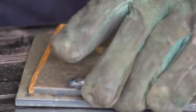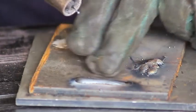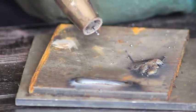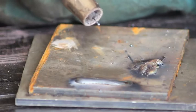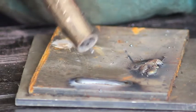But just for general purpose use, that is the kind of noise you want. You want that high speed — it's seeing a nice crisp note. And if you increase the amps, then you need to increase the wire to get that setting every time. If you decrease the amps, then decrease the wire again.